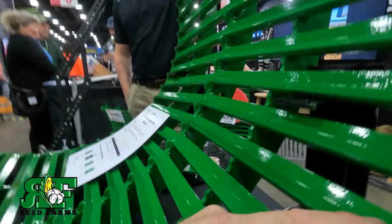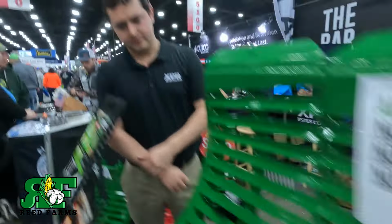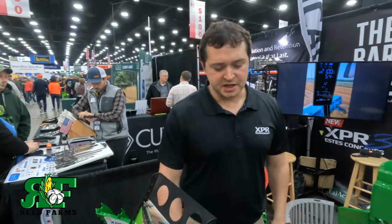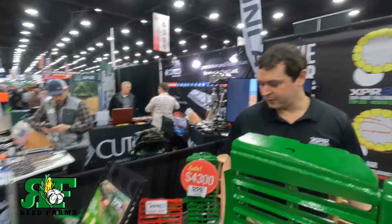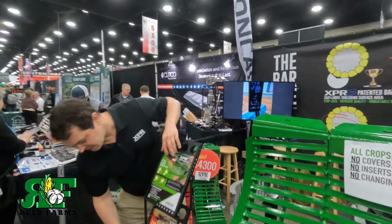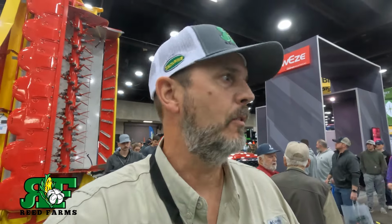I've said it again, y'all have seen it in my videos where I've got the concaves out on the ground. Here's what sets Estes apart right here, this Pac-Man lip. You can see this Pac-Man lip right here. And tell them why you've got the Pac-Man lip, what this notch bar does for you. Where's my prop? We're looking for a prop. But anyhow, what it allows is you're threshing grain on grain, not grain on metal. That's how you crack the snot out of corn.